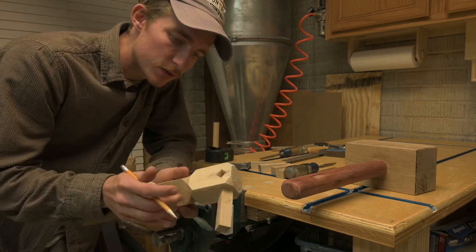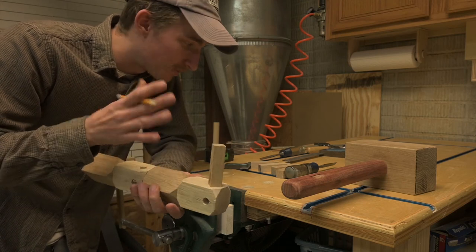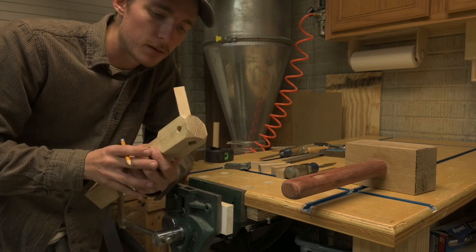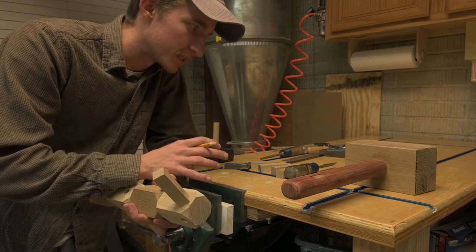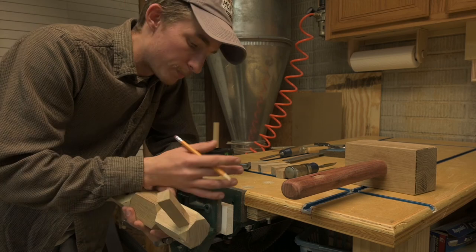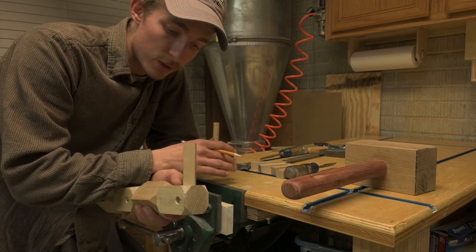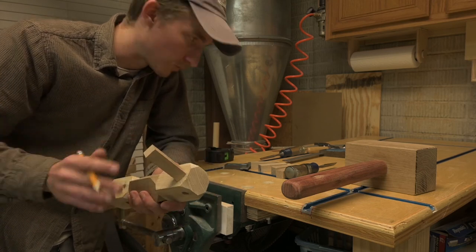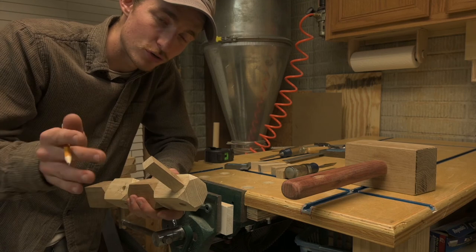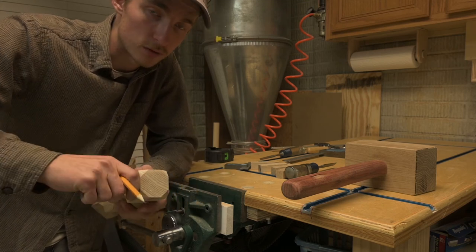When I cut these I pair them up with a piece and number it. Everything should be almost the same but it's always good to number things and put them exactly back the way you had it. That way when you go to do the glue-up, if there's a piece that's just a little bit off you're not scrambling to find which piece went where. If you number everything and keep it consistent during a dry fit, it'll turn out a lot better and you won't have any problems gluing up.